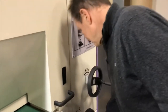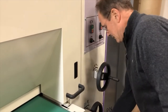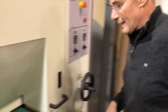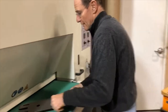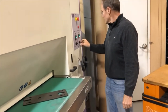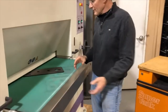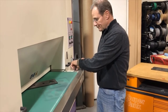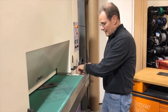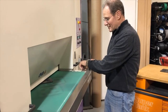We will start here, going heavy. We'll set the machine to 8mm material thickness. We know where this has to be sitting in order to go hard and heavy. We'll go slow — 2 feet per minute — to see if we can remove the dross. Even at 2 feet per minute, the part disappears in about 20 to 25 seconds.